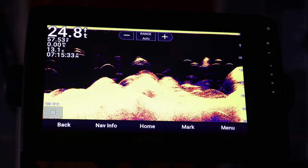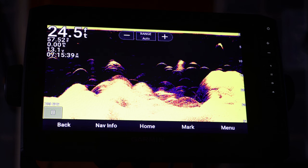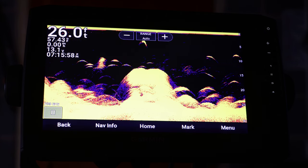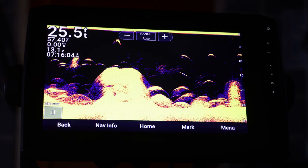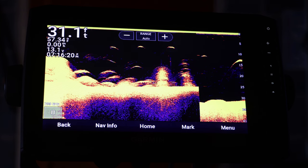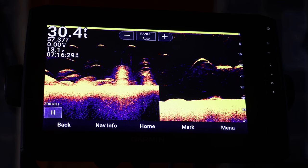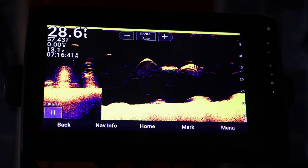The first thing I want to talk about, which is very important whenever you're using a fish finder — it can be any fish finder, not just Garmin — is how to determine what the bottom is. Depending on what your transducer returns will help you determine exactly what the bottom composition is. You can tell this is a very heavy return based on the color, so this would be a hard bottom. Whenever you're on a lake with a soft bottom like clay, it doesn't generate as high a return and will be a lot less bright and vibrant.